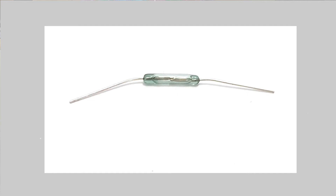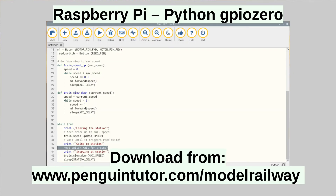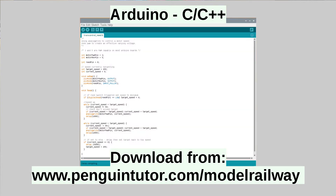In my outdoor setup there's more than enough space between the tracks. It fits quite nicely, though in Double O you might need to twist them so they go lengthways rather than widthways, and particularly with a smaller gauge such as N gauge. It will work with most gauges as long as you can fit the magnet on the bottom of the locomotive without it catching. As the train goes over it, it closes the contact — the same as having a button. We connect it as an input and use an internal pull-up resistor, so when the switch is open you get a high signal, and when the reed switch is closed it pulls down to zero and gives you a low signal. On the Raspberry Pi we use GPIO Zero and can just treat it like a button using wait_for_press, and on the Arduino you just check whether it's a high or low signal. The code is all provided in the links in the description.